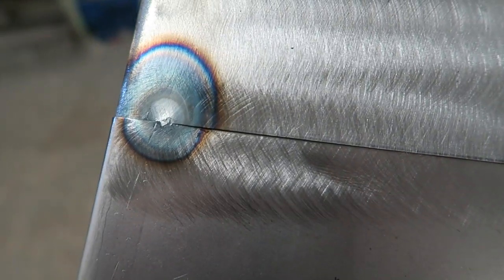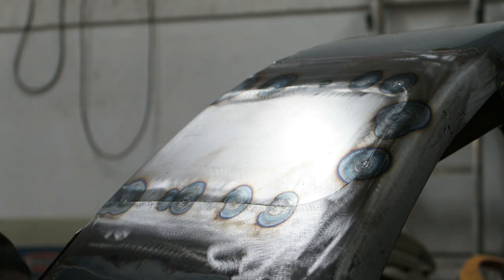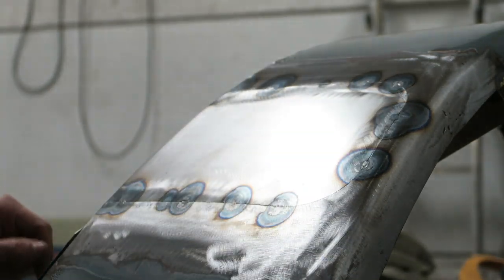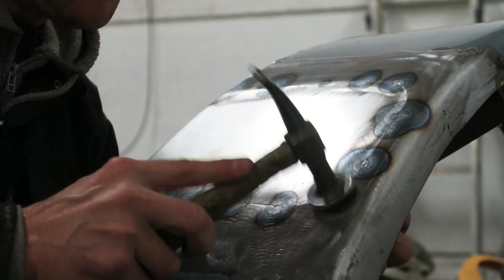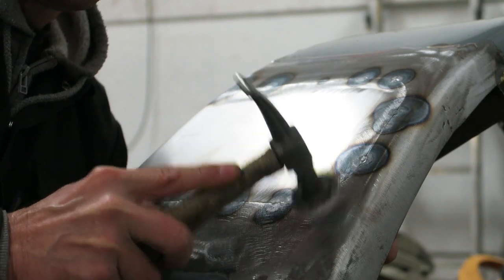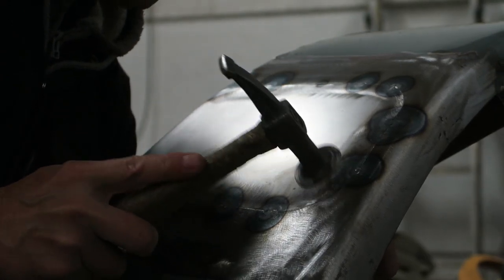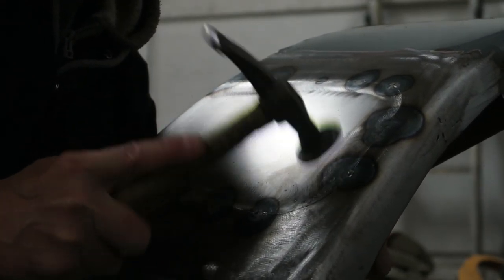So going back to getting it fitting flush, the type of welding repair I'm doing here is butt fusion with oxygen acetylene, utilizing no gap whatsoever, using the new panel and the existing panel as the actual substance of the weld. I'm not wanting to introduce any filler rod into this. I'm just using the material that's there. As the torch heats up the steel, the steel expands and pushes the two pieces together, and as they come together, obviously, it melts and fuses together.